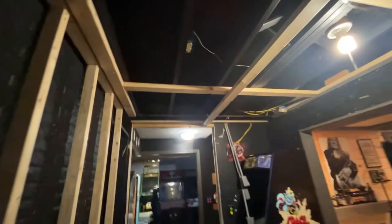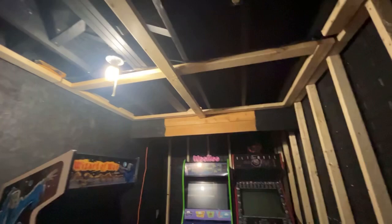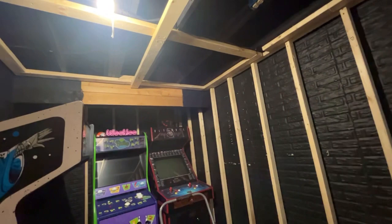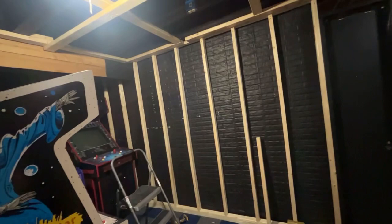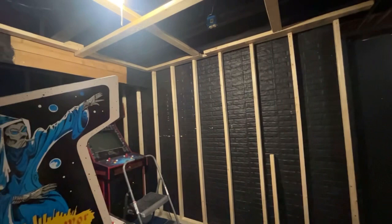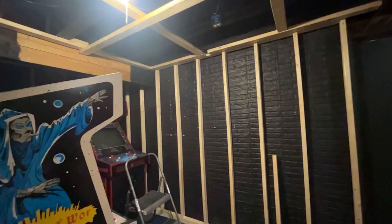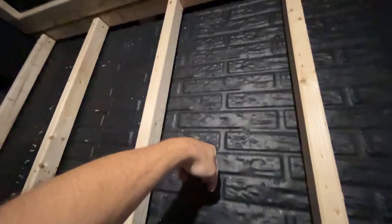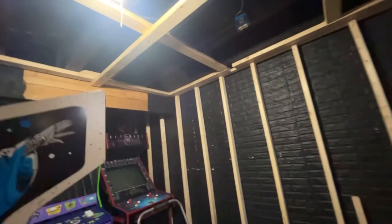I want to make sure that I really think it out before I go covering these ceilings and walls — exactly what I need for power, future power, plugs in the upper corners for possible fans or anything like that. That's all the things I want to think about before I start putting wood on the walls, because once the wood's on the wall you have to really tear it back apart to change or add anything. Now if I did forget something or in the future I want to hang a TV and pull a plug, that's really not a big deal because I can drop this ceiling panel down, fish a wire right through there and down the wall. Anything down low you want to try to just do ahead of time — it's better to just be done with it once and not have to worry about it.